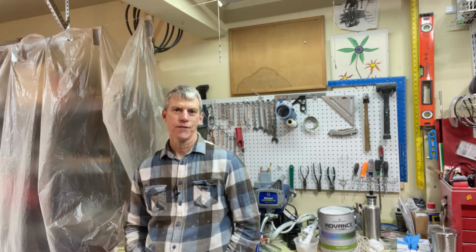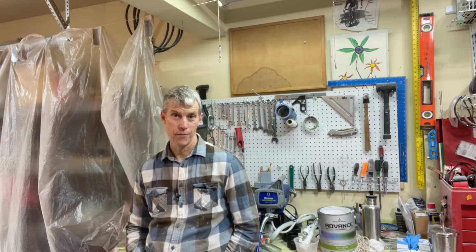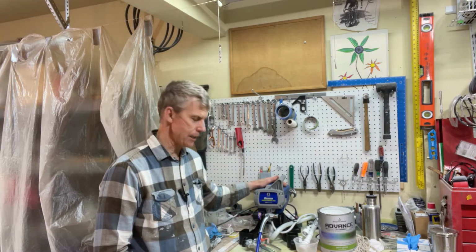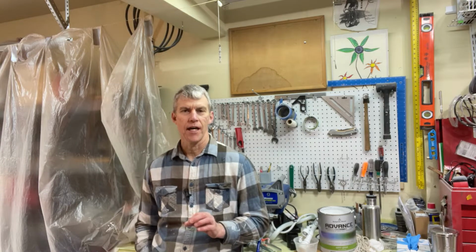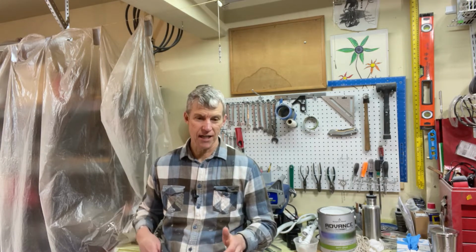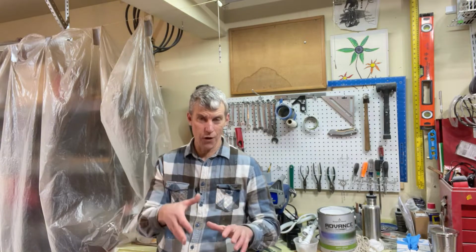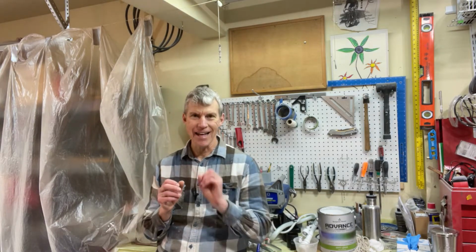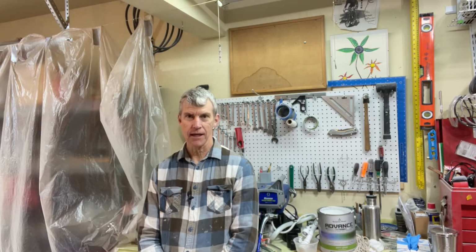All right, well, I just finished painting with my new Graco, and I gotta say, I really like it. Now, it did leave some drops that flung out of the tip, and so what I've found is that if I just start my spray down, or at least not above my project, then any of those that come out will land on the floor, and then I go up from there. All in all, I liked it.